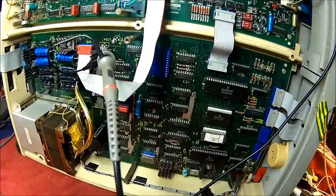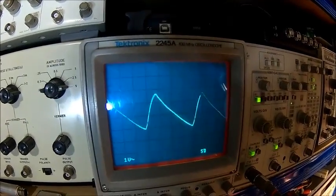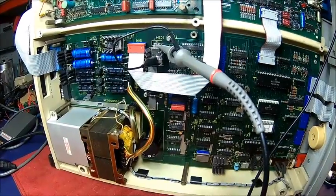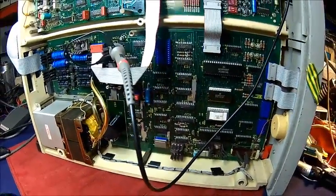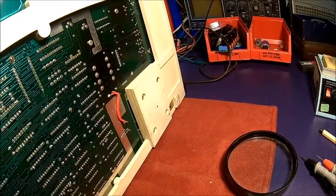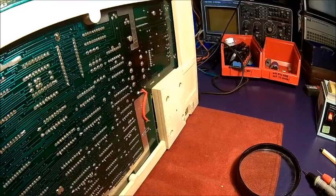I think I found the reason for our problem. On the oscilloscope at 5 milliseconds per division, the ripple is at 50 Hz — but this is a bridge rectifier, so it should be 100 Hz. Something isn't right. It's almost impossible to figure out in-circuit, but I have a feeling one diode is bad. I'm going to pull all of them and find the faulty one. Got it out — it still measures 25 ohms, so it's dead. That's a new 5408 diode, brand spanking new.